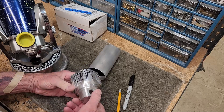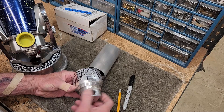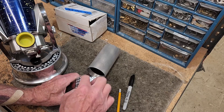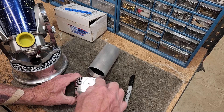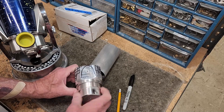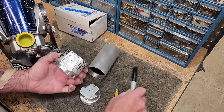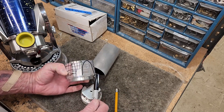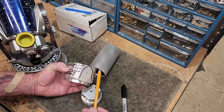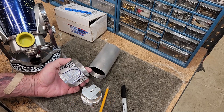I could try to cut it away and will probably end up using a saw for part of it. But I want this to be nice and round and shaped as much as possible. So I'm going to put that on a rotating table on my milling machine and I'll be able to turn around this radius here. This radius will be pretty easy to do, and then all I have to do is get rid of all of this — that will be the tricky proposition.